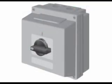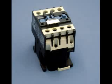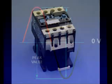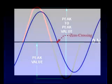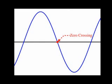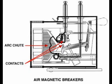Medium and high voltage switches employ one of four different arc interruption technologies. All take advantage of the fact that even the most powerful AC currents pass through zero current levels twice each cycle. By reducing the amount of conductive gas between the contacts, the arc cannot be sustained when it passes through a zero current. Some large switches use the arc to generate a magnetic field that forces the arc into arc chutes, which lengthen and cool the arc, allowing it to extinguish at zero current.